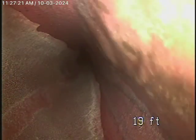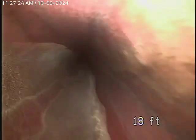We're on the outside of the house now — that's the outside of the house with the clay pipe, which we've already seen. Obviously, the cast iron pipe underneath the slab is definitely getting old. You can see there's a little bit of rust buildup once we flush the water through. It looks like it's in fair condition, but you can see it has some rust buildup.